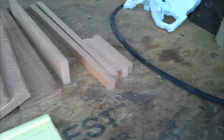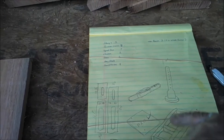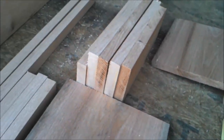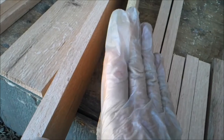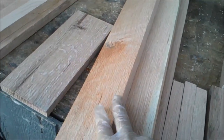What are we missing here? Oh, and the plunger piece. So this piece right here will be that one right there. I made these 20 inches, because you can subtract an inch and a half here plus the three-quarters of the plate — there's two and a quarter inches that it doesn't need to be. I don't really need it sticking up past the top too much. What we have left is this lever arm that will apply the pressure. We have this half-inch stuff that I have yet to rip down. I want to set my width based on what I do with this. This piece was a leftover — all that right there is the rest of it. This is a leftover from one of the wide ones. I've since ripped it down to clean it up — I want to get close to two inches, but I'm not quite at two inches; it's going to be about one and seven-eighths.